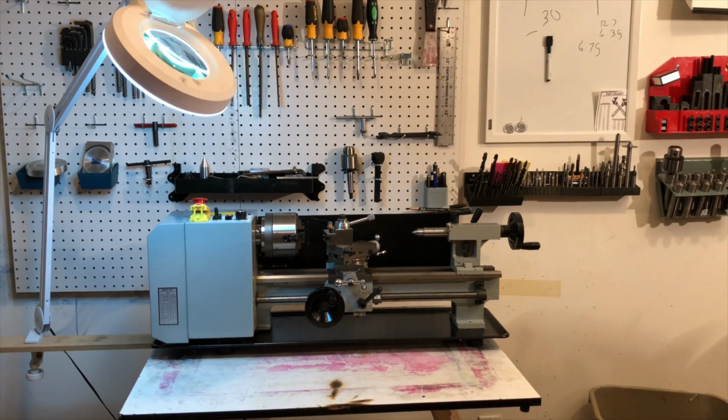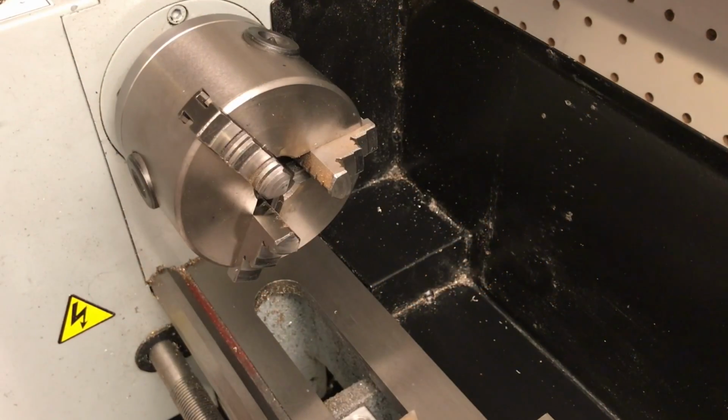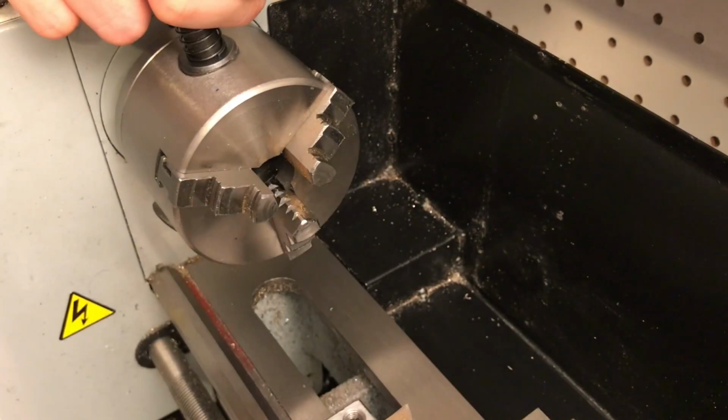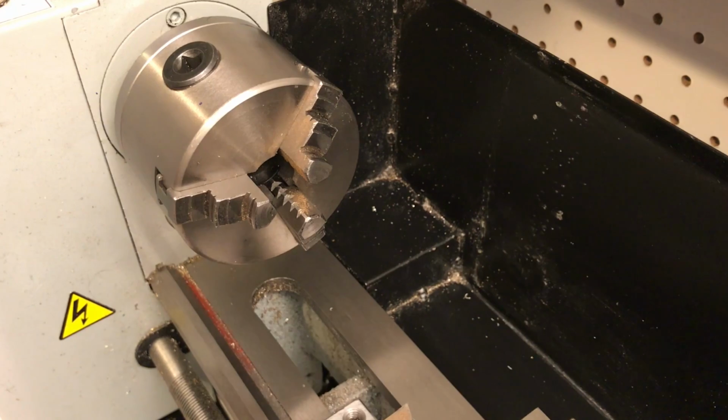Be warned though, when machining cast parts, make sure to clean off all the sand. Sand can be very damaging to precision machines. A single grain can cause a lot of damage. So at the lathe, there is a problem. I can't hold the part on the outside, as all surfaces must be machined. And because of the taper, I can't hold it on the inside. So what can I do?